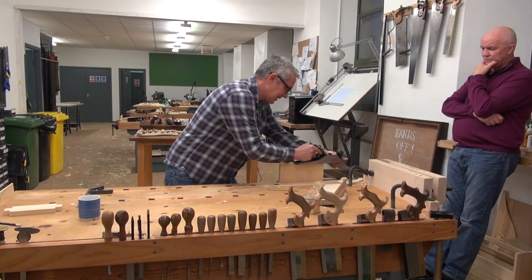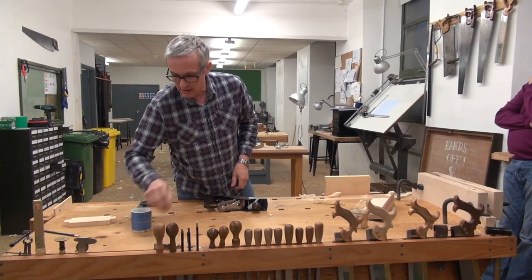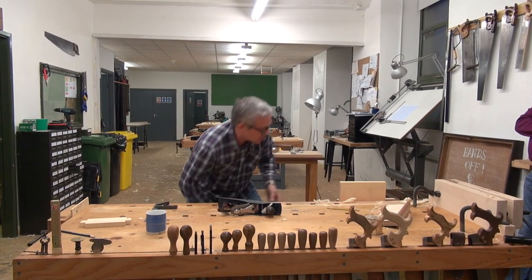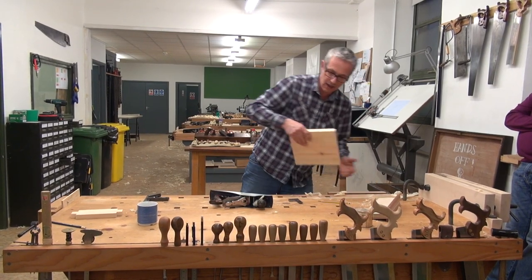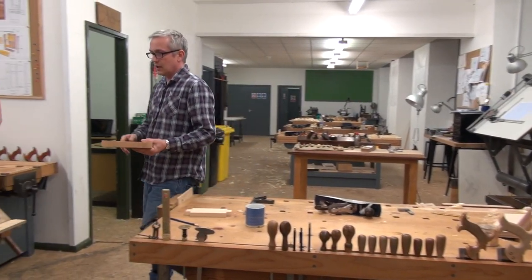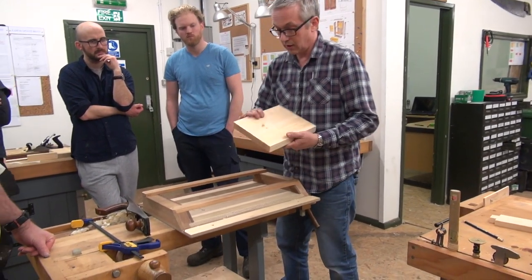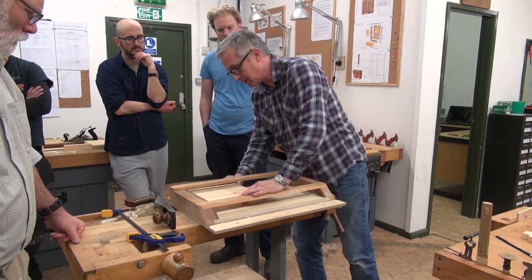Back to the 21st century. Just plane that down to your line, make sure you square it, and that's pretty much guaranteed to be right. There's a cheat for this as well — a shooting board. It's designed for end grain, but it will also do ordinary grain and these edges. You won't do them very quickly, but it will do it very accurately.